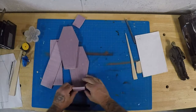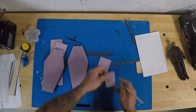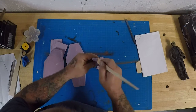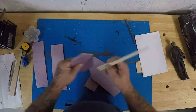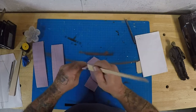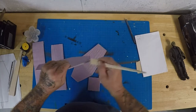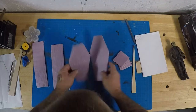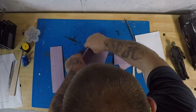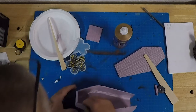I'm doing the side pieces here, making sure to go in the direction of the grain — we don't want to go up and down on the sides when the wood grain is going horizontal. Make sure to get the end pieces, the tops and bottoms of the head and foot, because when you open the coffin you'll see those edges directly. You want to bring the texture up on the top, bottom, and sides of the coffin lid because these parts are going to be visible. Now I'm just rough fitting, making sure the sides are flexible and long enough before I start gluing.